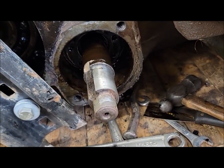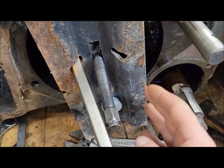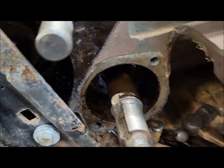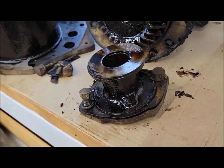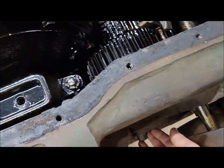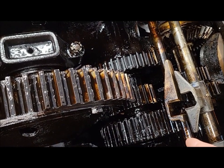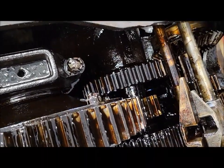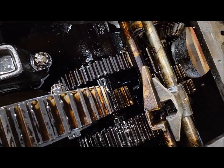Over on this side, I did pull the bearing cap housing off to get some more clearance for my pusher setup. There's another Hyatt roller bearing inside of there. Here's the cap that held it all in place. I'm assuming it's probably a similar thing on this side — once this cover comes off there's probably a bearing inside, and these must be keyed to that shaft. Trying to get that all apart could be fun depending on how tight things are, without wrecking anything.